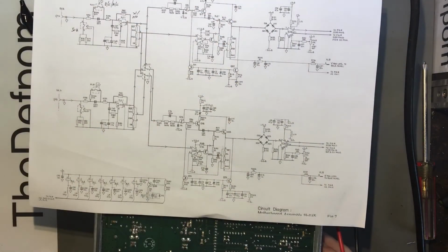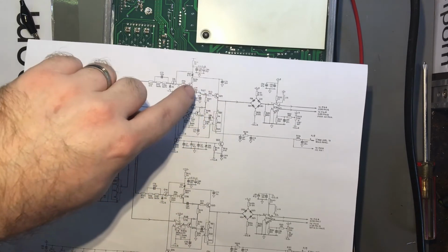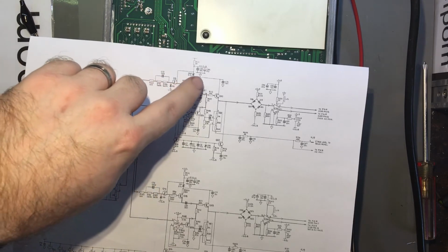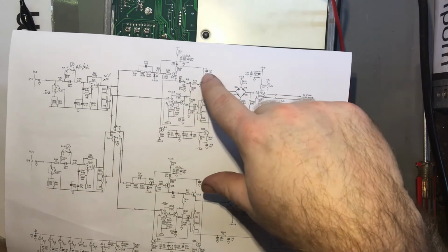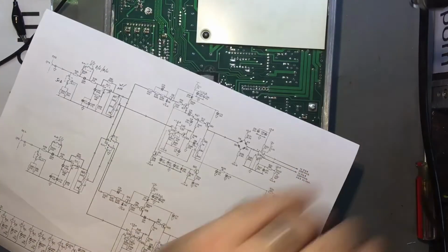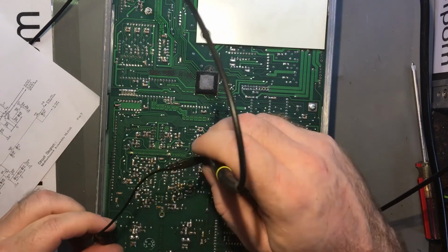What else can I check when I'm under here? This video is going to be going for ages, isn't it? While I'm waffling on trying to figure this thing out. So that's okay, that's okay. That relay appears to be shut to 1 and 7 and 8, which is what I'd expect it to be. So signal comes in. Sampled here. Signal comes in there as a base signal, so I should probably get the scope on it and see what I can measure as well. Let's get this hooked up again. Okay, I want to stick this on earth one, which won't fall off, hopefully.